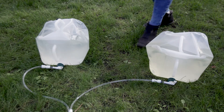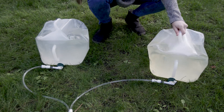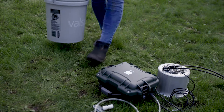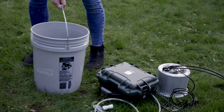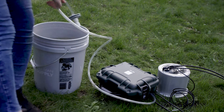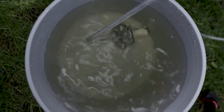For highly permeable soil, use the second collapsible bag with the Y connector to supply 10 gallons of water to the control unit. If 10 gallons aren't enough, a larger container can be used. To use a larger container, place the tube at the bottom of the container and use a set of washers to ensure the tube remains underwater throughout the test.